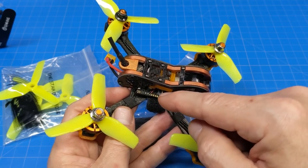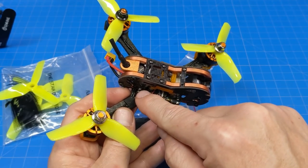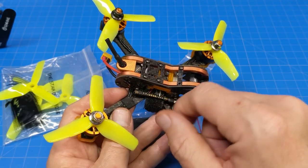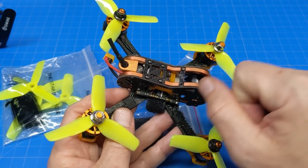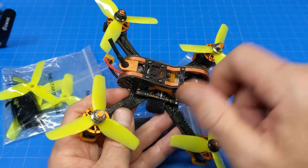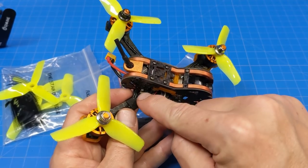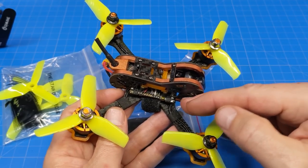What I ended up doing — trying to remember from several years back — I took a pair of fingernail clippers and used the edge of that clipper to just scrub and scrub on these wires, twist them together, and scrub again. I just kept trying to scrape off that enamel on each individual wire so I could get enough bite on there.